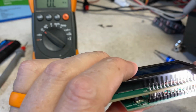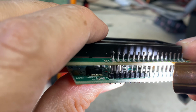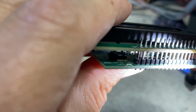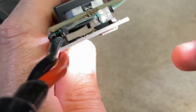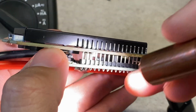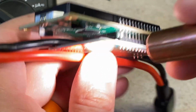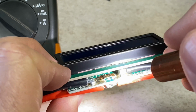Okay, I see one diode on here. There we go. You can barely see it between the pins there. I'll see if I can highlight it in the video. But that diode is tiny. There's no way that thing handles the amperage that this is actually letting through. Dollars to donuts, the one diode that I see here is specifically for sending information or the calculation part, and not on the actual big side of letting the big pixies go through.